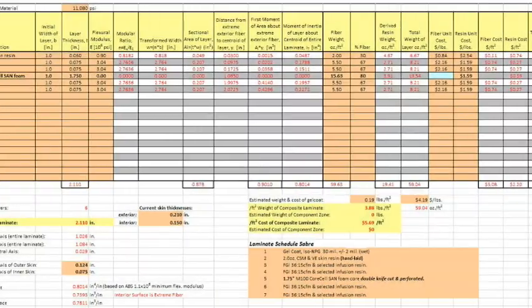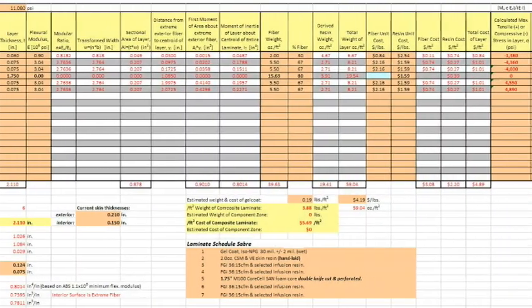A lot of pressures are determined from this, and they range usually at 9 to 12 psi, or 1300 to 1700 pounds per square foot. With that information, we then design a laminate of our hulls — shown here on our spec sheets — that will withstand those forces. Those forces are also looked at from the internal structure to make sure that the structure supporting the skins of the hull can withstand that.